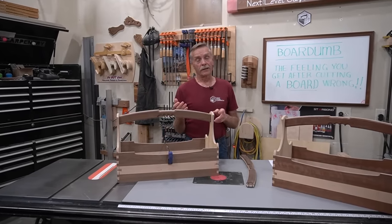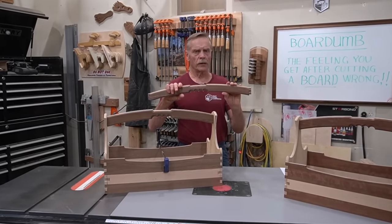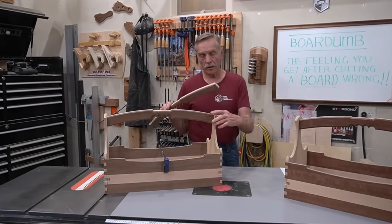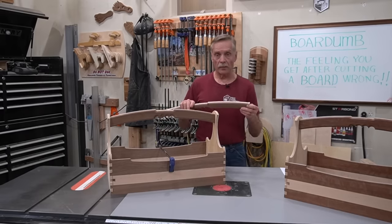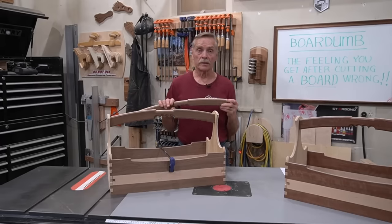Except for the fact that this is the point of the video when I discovered that the 1 3/4 inch handle width and the position of the tenons on the ends left corners of the mortises exposed, and I had to backpedal to correct the problem by making 3 new handles 2 inches wide with lowered tenons to get myself out of the predicament.